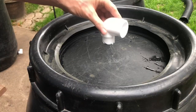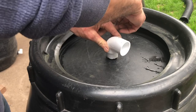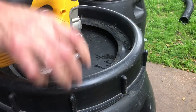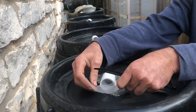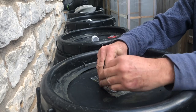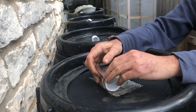The next thing we're going to do is cut a hole in the top of each barrel for an air vent. I just used a three quarter inch PVC elbow, and these vents allow air to escape as the water comes in the bottom of the barrel. Once you have those popped in, make sure you put some sort of screen or cloth over the end of the vent so that bugs can't get inside. Mosquitoes would love to go in here and make this their home.